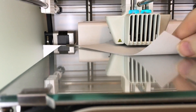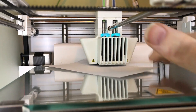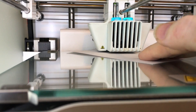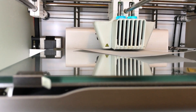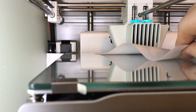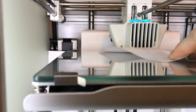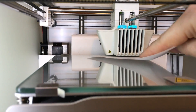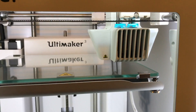I'm going to stick the paper in there. As you can see right now it's too low, and I can just move the paper back and forth freely. I'll raise it a little bit. Now I'm starting to feel some resistance — that's probably a little bit too much. I'm going to back it off a little bit. Now we have it at a point where there's just a little bit of resistance on the paper. That's about the right height for the leveling. I'm going to push the button to continue, and it's going to move to each of the corners where we'll repeat that procedure.